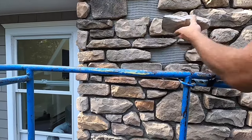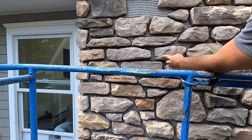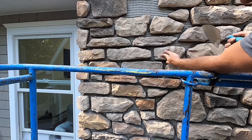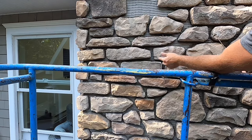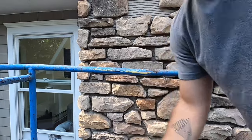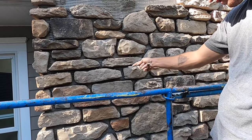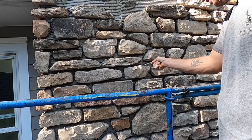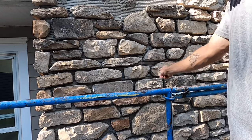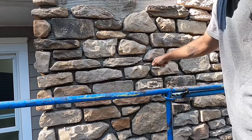All you do is stick the stone in here. I use my fingers as spacers — sometimes you dry stack it, but in this case we are spacing. I hold it until it doesn't move, then let it go. I don't clean up anything — you can smooth the top sometimes, but I just let it go until it gets hard. After it sets up a bit, take your slicker and scratch out around the rocks you laid. This makes it better for when you point in your joints, which makes everything look nicer for the end product.